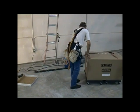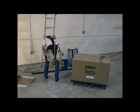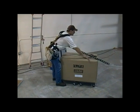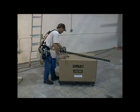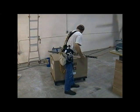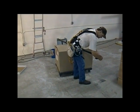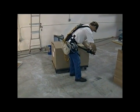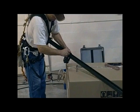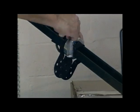Here you see the speaker being brought into the installation area. This speaker was prepared earlier with its hardware at a different secure location away from the job site. So at this point we're ready to take the gimbal and the collar assembly that was supplied with that. This particular assembly on our price list is listed as the G3 option, which all systems come with one of the gimbal assemblies. We'll move that into place and tighten the bolt to secure it there.